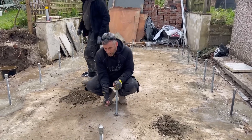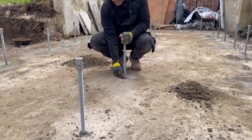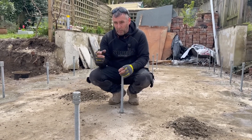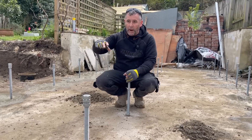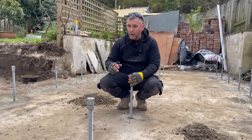Because the concrete was three to four inches we've gone in three inches deep and resined that in. Tomorrow we'll wind the nut down and that will stop any drive-through. Bear in mind this is just the middle of the pad - there's no structural weight on it - it's literally just to take the bounce out of the floor, because over that span the 4x2 isn't big enough, but with the joist in the middle it is.